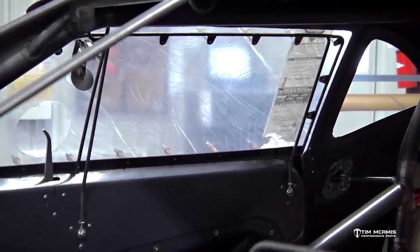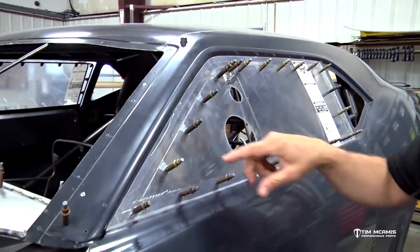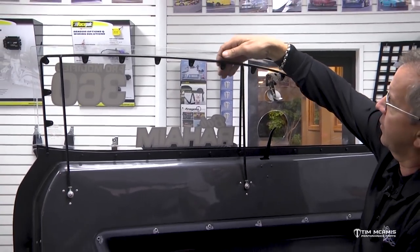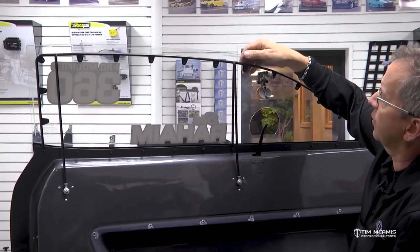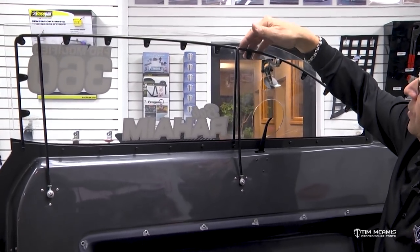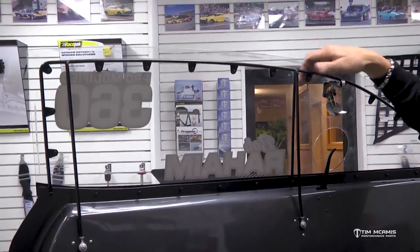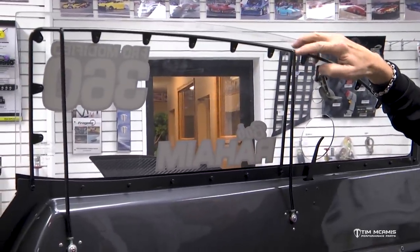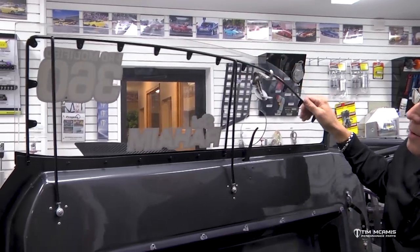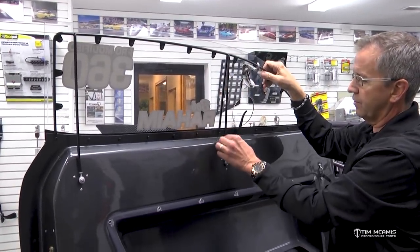You're going to have to be real careful when you're putting this together because there's some welding to do right here. When you are building this, if you're using the actual window that you're going to put in the car, the windows when they're new will have a plastic coating on each side. If you're going to tack right here, you want to get this away from that window. This would be clecoed on while you're temporarily holding it — pop those loose and get a piece of aluminum, like 60 thousandths aluminum, tape it up and slip it in between there so you can put just a little zip tack on that tube while putting it together. Then once you do that, take the window out and complete the welding. You're going to have a couple of joints up here that need to be welded that are close to the window, but these tabs are already going to be welded for you. As long as you're careful, you won't have any problems — get that window away from it, tack it on, and fit that in first.